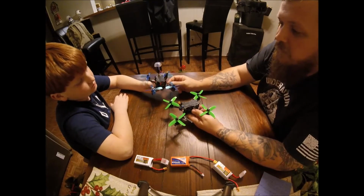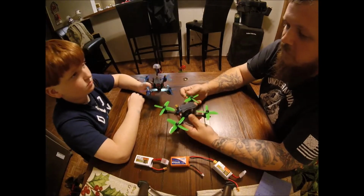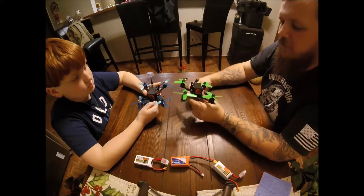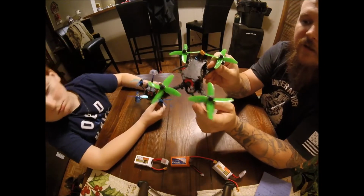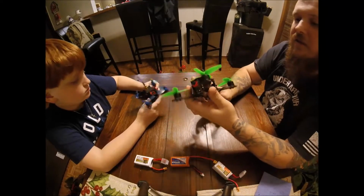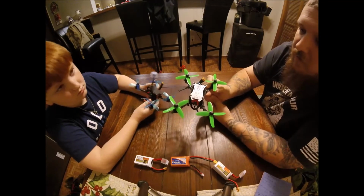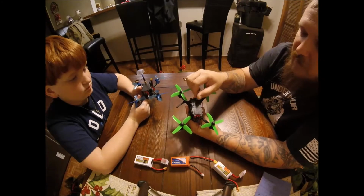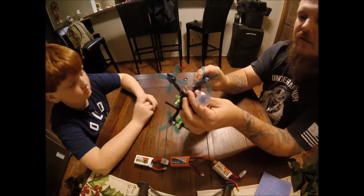The XM Plus is a full range receiver, and you really do get a lot more range out of that XM Plus. It also comes with a linear polarized video transmitter antenna, and the linear works. It's decent on 100 milliwatts, but I'd really prefer to have the SMA or RP-SMA screw on so I could do an antenna of choice on there.